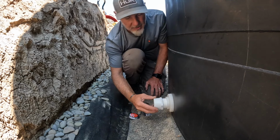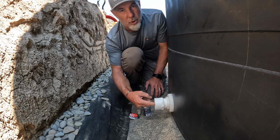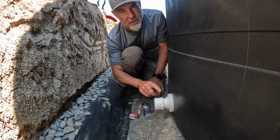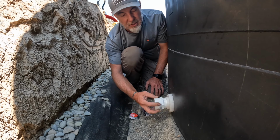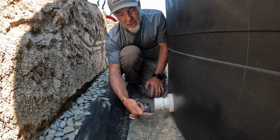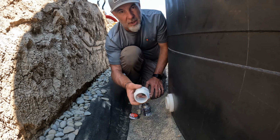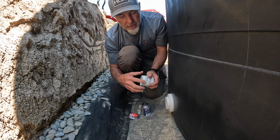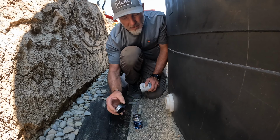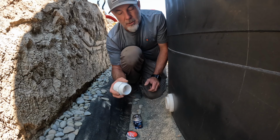All right, so here's our slip fitting to threaded fitting. This is gonna go on here. Then we're gonna glue the pipe and the valve on here, but it's important for me to put this on first, because if I glue this to the valve and then I start threading all this stuff on there, the valve could end up being upside down when this is tight. So I want to make sure that I put this fitting on first and pipe thread it, the double whammy like I said, and then we'll tighten this up